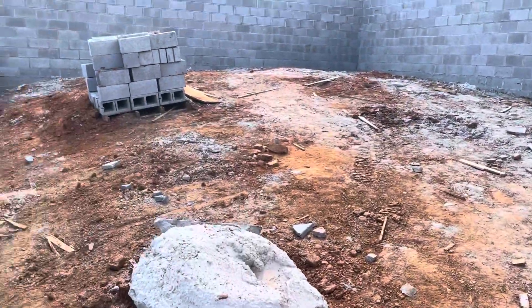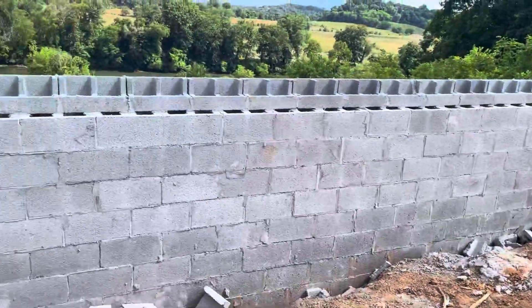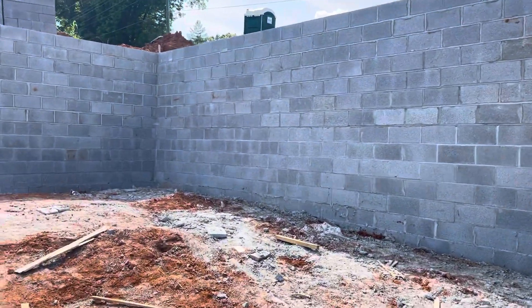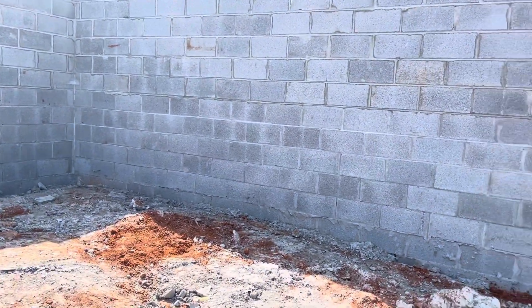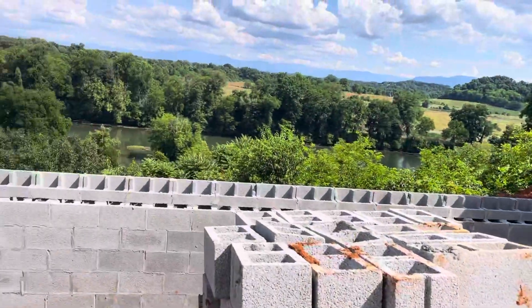You can see how the ground level actually goes up. So we had to go really deep in the ground there just to hit solid ground. Because it had such a steep incline, this has eight-foot walls inside. So we laid about eight feet, and once we put our gravel in here and our concrete, it's literally eight feet tall of walls.